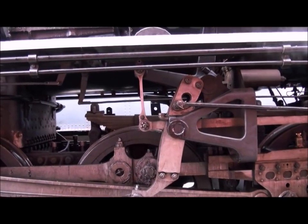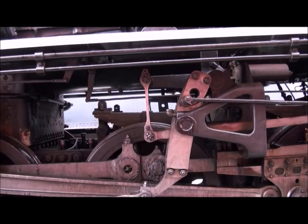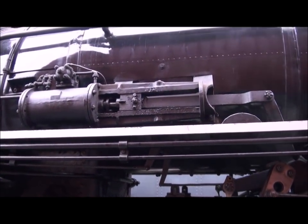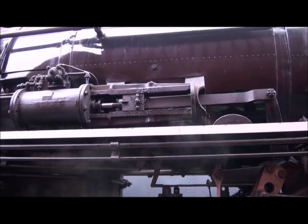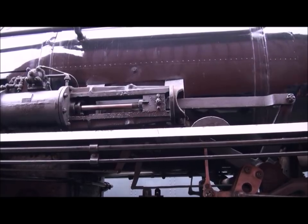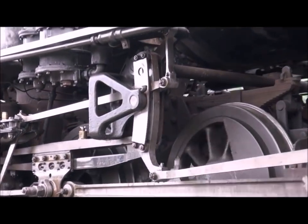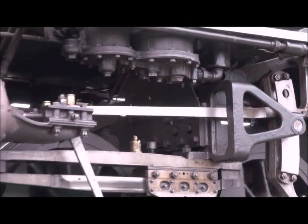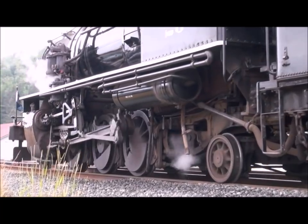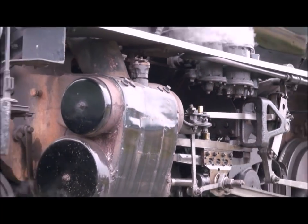As we start, we open up the cylinder cocks and blow some of the steam out, which takes along with it all of the liquid water — this is every time you start, not just when you feel like it. You can see the steam coming out of the bottom of the piston, from the drive piston. The upper piston is for moving the steam back and forth. With the reverser, if you put it all the way forward, you can think of it as first gear — as you move it towards the center, that would be second or third gear. This is a power reverser, so it's not real hard. When you're using the throttle, little increments — you've got to move it a little bit and wait and see what happens. Remember that the steam has a long ways to go before it starts doing something. Every time you change your throttle it changes the fire, and every time the fire changes it changes the pressure, and every time the pressure changes it affects your throttle. Everything's hooked together here.